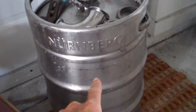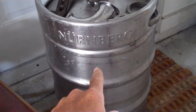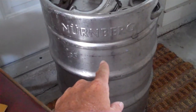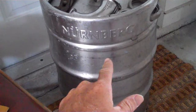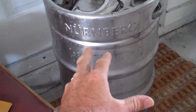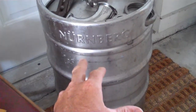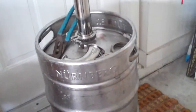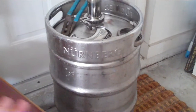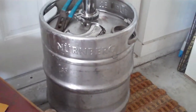So we've got a 13-gallon boiler here. We can put a 4,500 watt element in this thing, and if we put a variable controller on it that's 100% variable, we can install some input, install some heat. And as long as we keep the purity levels up at the top of the apparatus where the botanicals are, I think we could keep the botanicals safe from being exposed to too much heat.